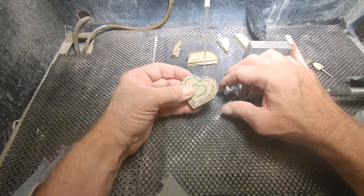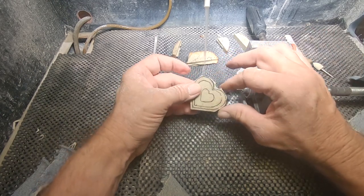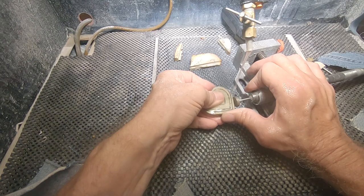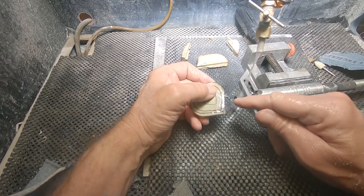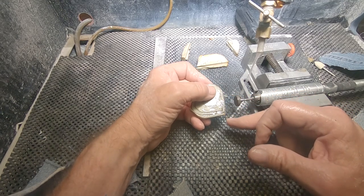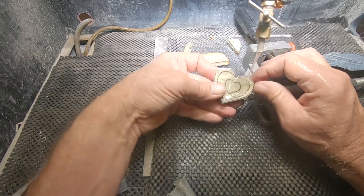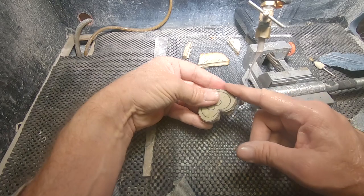Let's do a little bit of cleanup on this. I have a 150 grit round square head burr and I'll go ahead and start cleaning some of this up. You'll notice I put this back in the vise — after a period of time your wrists get a little sore. You can see the reason I'm using such a square edge bit is so I can just follow right along the line and get a nice square cut. I'm going to end up rounding it over, but it does a pretty good job keeping a straight edge. She's taking shape, looking better.